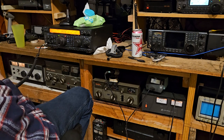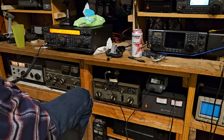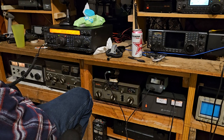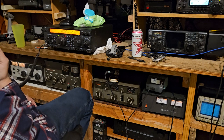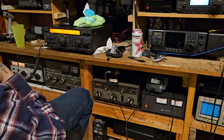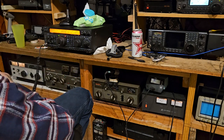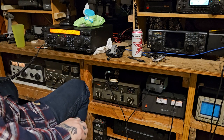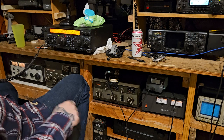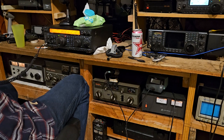It would warm up. This is what's frustrating — it's a nice radio, I mean really it is. I think it's from about 2003. Why is it off frequency? Why are these radios aging? And yet other radios don't. Even my Kenwood 940 isn't off this much. You saw my 950 — it was off too, and Clark was able to go to the secret menu to adjust it. I always hate doing that, because it means something in the radio has aged.